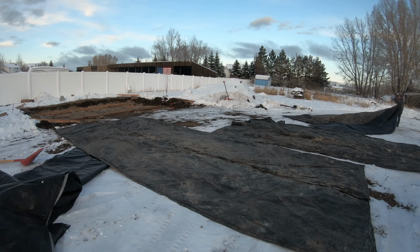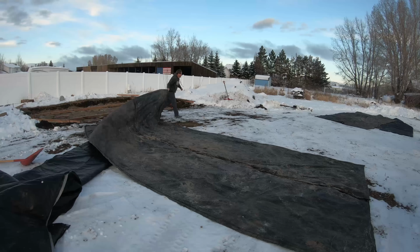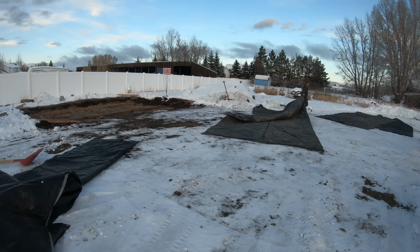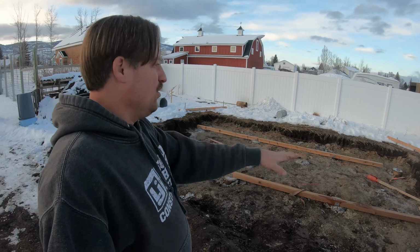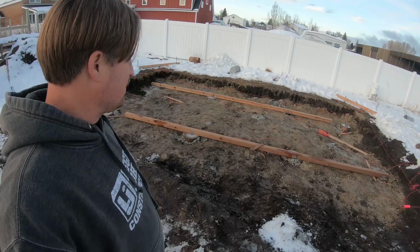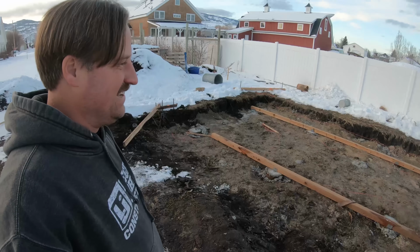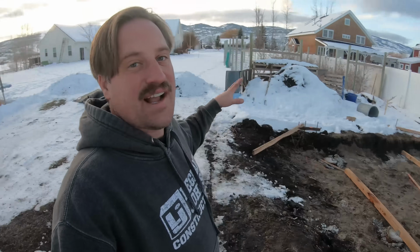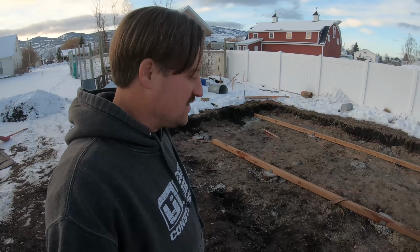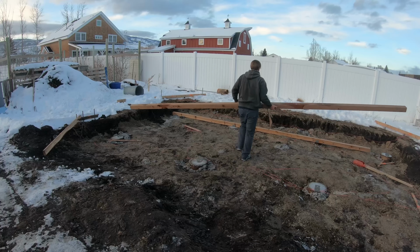All right, folks, I'm working on my shed project. See right here, I've got the old hee-ho pit where I'm working. But I need to dig around these pylons here. You can see these concrete pylons. The elevation is too high around them. So I need to get the track hoe, which is behind me, to dig around each of these pylons and then make the hole just a little bit wider.